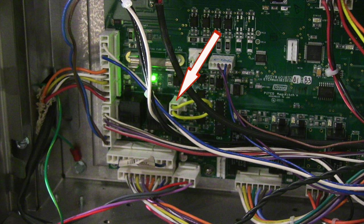This 2 pin terminal is to connect the element tilt switch on electric units. For gas units, it is jumped as seen here with a yellow wire. This 6 pin connector is used for the oil flush hose and manual return valve if equipped on your unit.